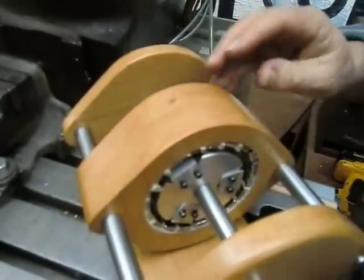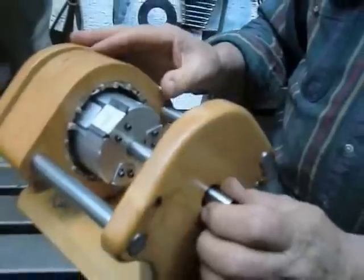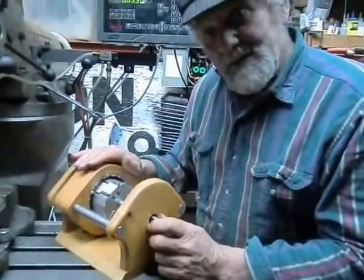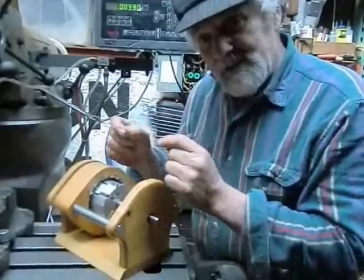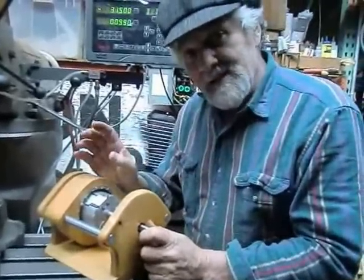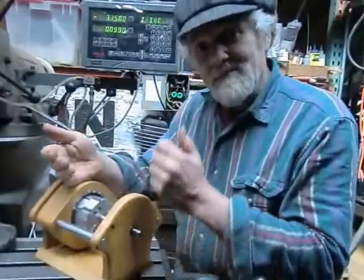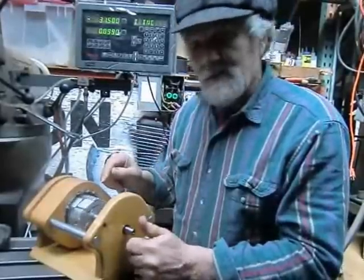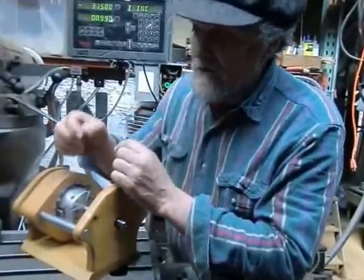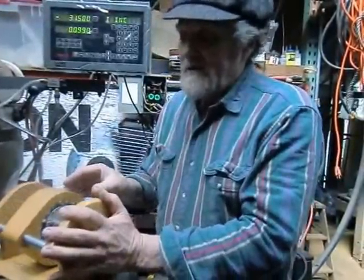So what I have to do now — and I hate to because this is such a pretty stator — what I have to do is take the stator off and set the magnets up on another base or another stator frame to give each magnet the ability to adjust sideways and up and down height-wise to the rotor. Because I think what happened is all the magnets are different — they have different strengths, maybe just slightly different, but enough to make one magnet a little stronger than the other, which means the rotor doesn't want to turn freely. Maybe I can also reconfigure the magnets so that it's a strong, strong, strong, stronger, strongest sort of magnet. But I have to set it up so that the magnets are adjustable.